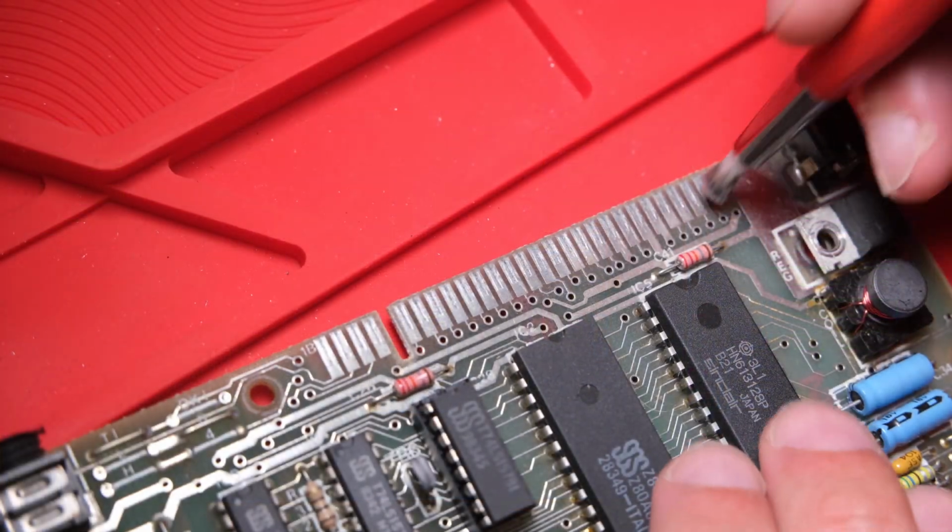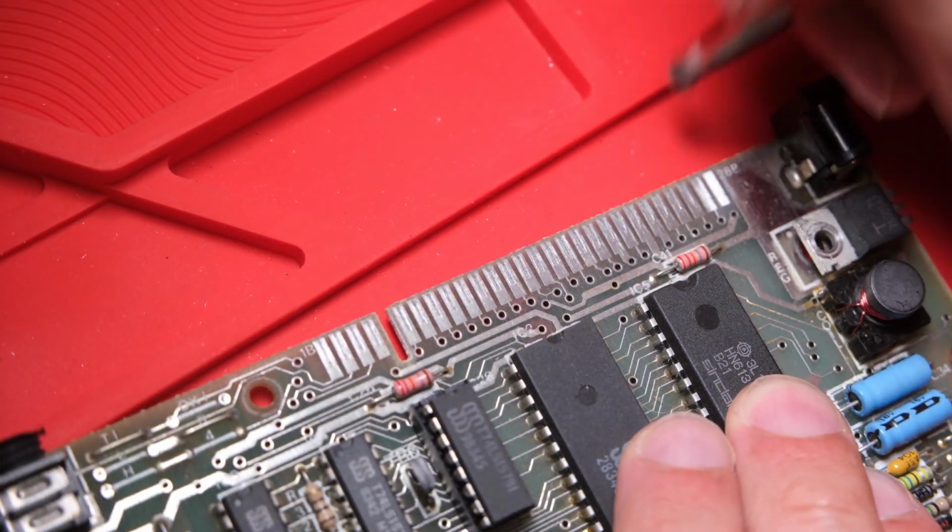Well, it looks like the external ROM can't run, or, well, it's trying to run, but it's really not going very well. See these green flashing borders and the red flashing border? That is trying to tell me which RAM chip it thinks has gone wrong. It looks like the fourth one in there from that last screen.